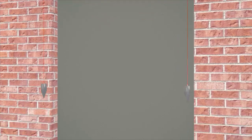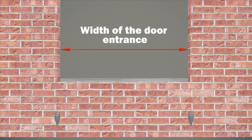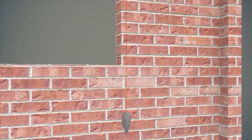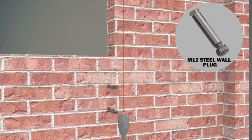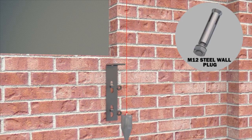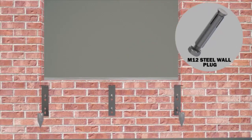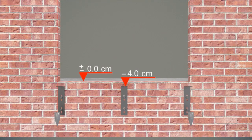For assembly of lift landing door frame, two plumb lines in door size are thrown into the lift shaft where the lift landing door is to be hung. The lift landing door package is opened and assemblies are done at level. Metric 12 steel dowels, two in number, are supplied by the assembler company and mounted to the wall at each sill bracket, four centimeters below the ground concrete, to collect lift landing door elements: sill plate, side frames, and frame upper plate, outside the lift shaft.